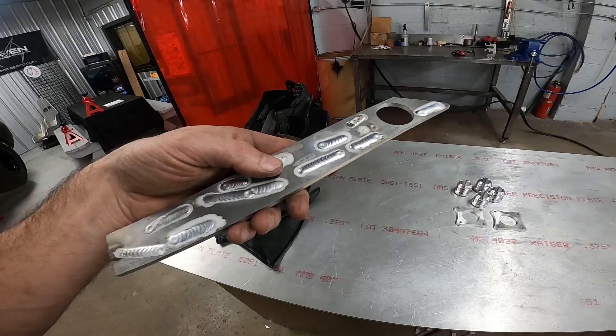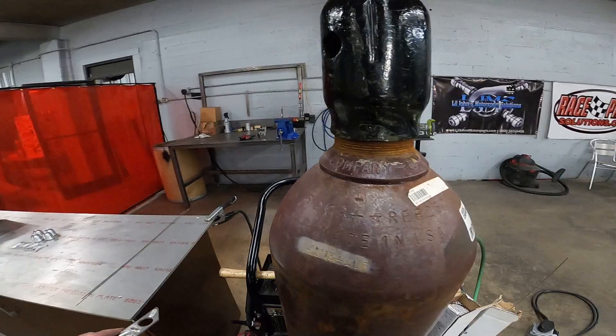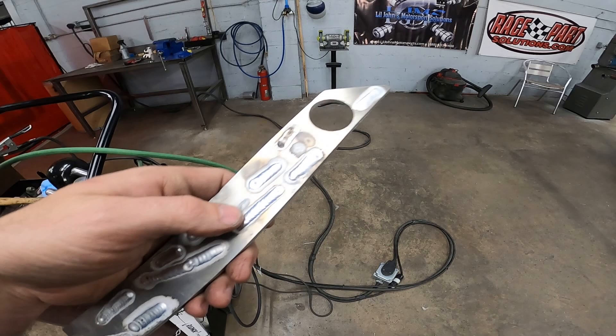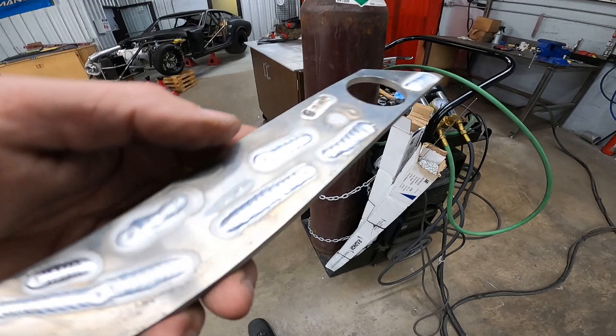Stainless will probably be the next thing, and then chromoly and stuff — you can just crank the gas and it's going to do good either way. But right here I've got a scrap piece of aluminum. What I do is keep this hanging on my workbench, and anytime I put a new bottle on my welder — like I'm about to right now, see it's brand new, she has the plug in it — I will lay this piece on the workbench and run just a little short bead on it after I get my gas hooked up and flow adjusted.